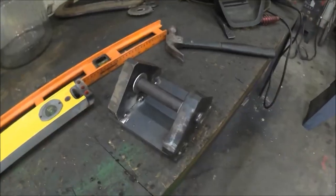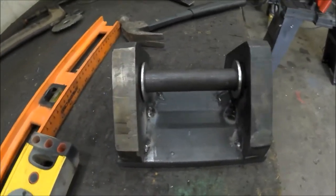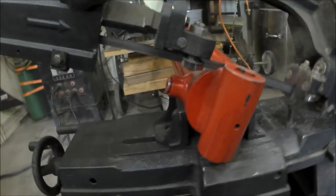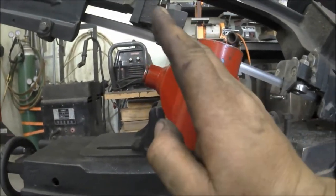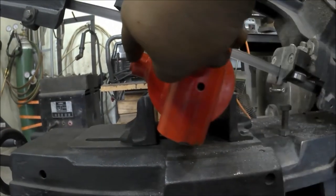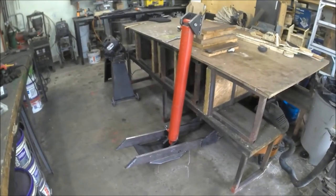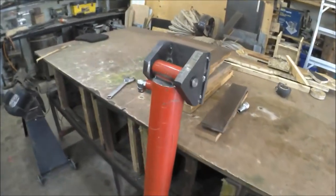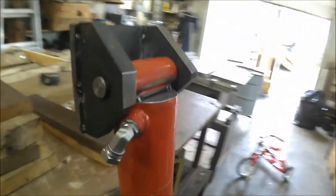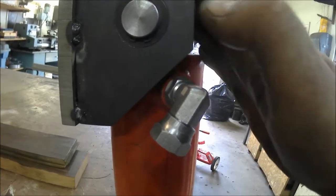The top mount is done, just tack welded right now so I can test it first. Then I realized I can't believe I have to cut the pivot off — this knob is at 90 degrees but I need it oriented differently, so I'm cutting it off, turning it, and welding it back on so the knob and hose don't get in the way. I installed the top and tack welded the pivot point. The fitting is now at about 67 degrees — I was nervous the bottom wouldn't fit but it's still going to clear as the thumb flips up and down.